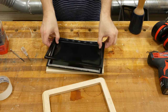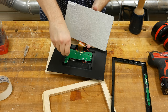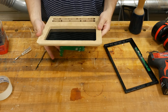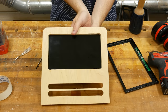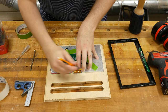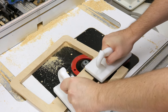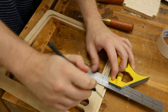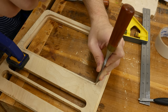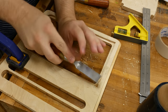For this project, this is a 10-inch LCD screen that I picked up from Amazon that worked perfect. The quality of the screen is awesome and the games look amazing on it. I did a test run of putting the screen up behind the panel and everything looked pretty good. To fit the screen, I did an outline to make sure the rabbeting bit at the router table would work, then used the same quarter inch rabbeting bit on the inside of the panel. I had to square out the edges using a chisel because the screen is square and the router bit leaves rounded corners. I also had to make one little notch on the left side for the cables.